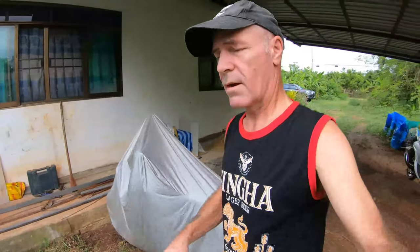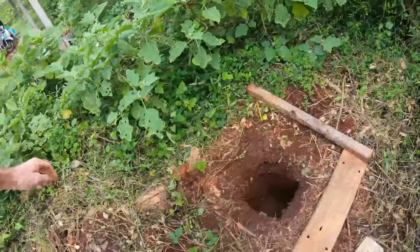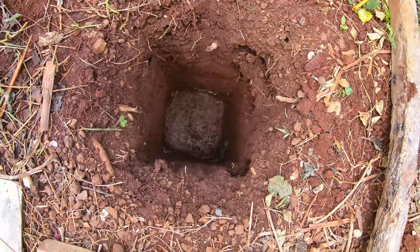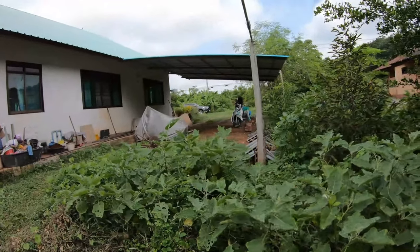So let's go and have a look at the post hole. The padstone we put in has hardened off. It got a little grubby where it rained and a lot of the dirt went down there. You can see it's ready to accept the post now. So I'm going to order the post up today while I go in to see Ratna — hopefully they can deliver it in the next couple of hours. I'll film it going in, we'll level it up and concrete that in today as well hopefully. There's a lot of work to get on with but we're making progress. So I'll get cracking and I'll probably do a time-lapse with the concrete.